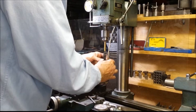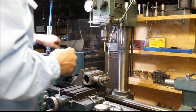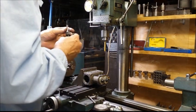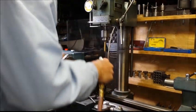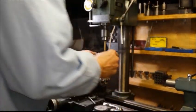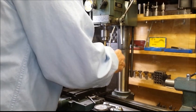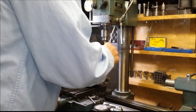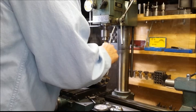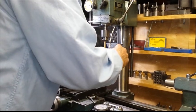I'm going to go in there with a bottoming tap, try and get as much thread as I can. I'm going to use a washer underneath the drain cock to help align it — I'll have to make a special washer that fits. Still, I'm going to be right at the limit of the depth of thread for that drain cock to thread in there.